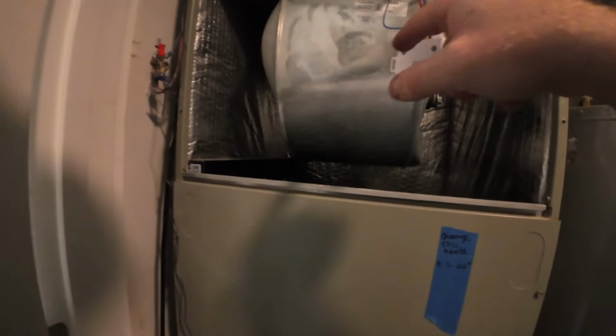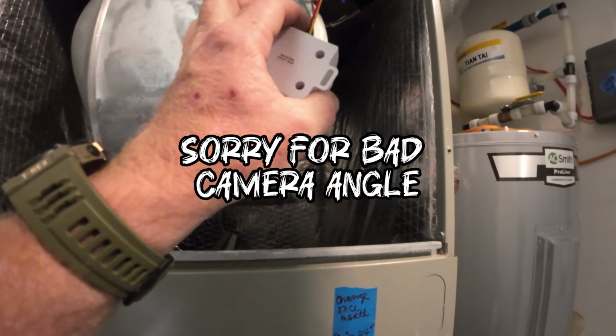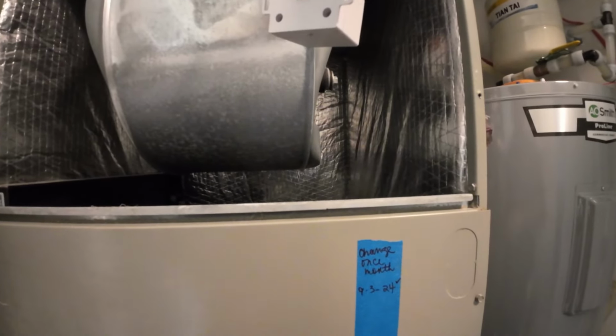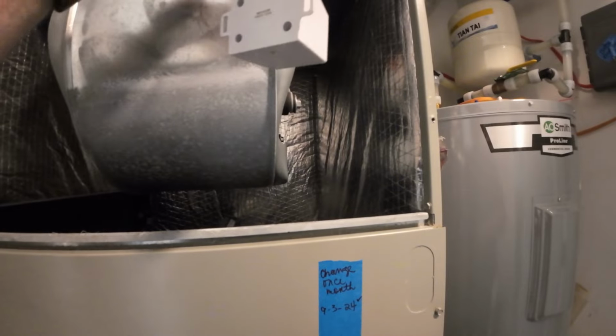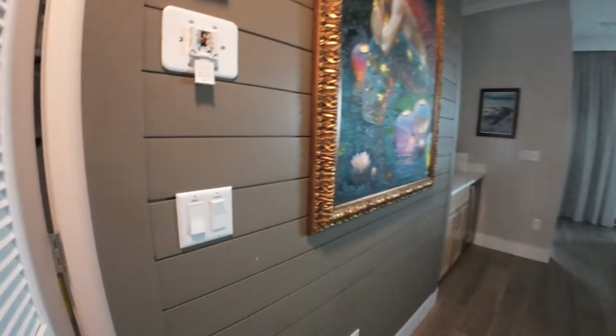And then here goes in, and then this little box sends out to yellow, and then green to fan up here. Everything else is wired the same. So I pretty much just got rid of yellow, like right over here. I actually got rid of orange because it was the ugliest, and I tied the yellow to the reversing valve outside over here. So just imagine this yellow is orange, but that's reversing valve.